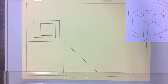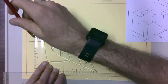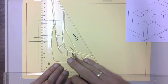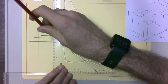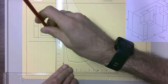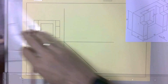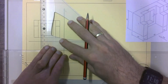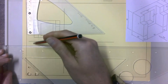Because it's orthographic projection from my front view, I can go and project each of these side lines down, so I don't have to measure them. I'm going to project a line down from each of the lines I have in my front view — that means my top view will be in line with my front view, which it has to be, and it will also be accurate. I'm also going to measure 10 millimeters away from my XY line and draw in a construction line for that.